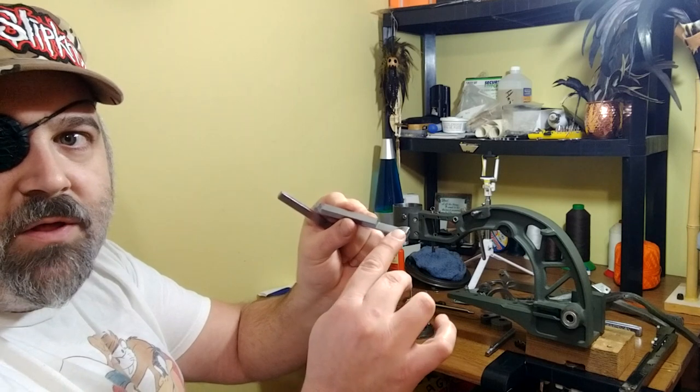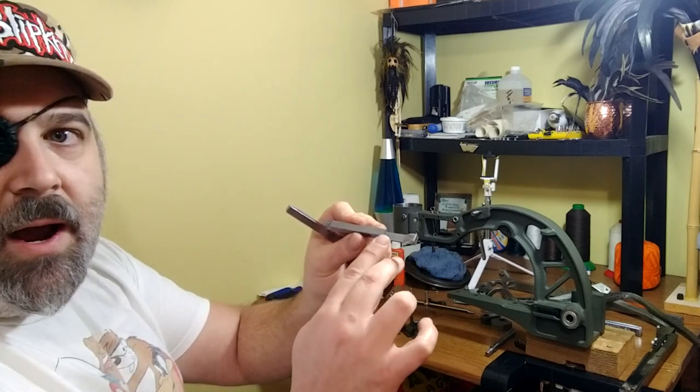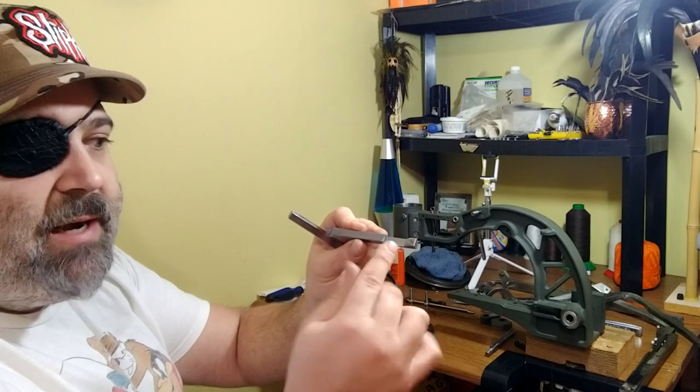We have the upper plate and both of these. There's one rod that has our presser foot on there, and then the other rod that controls the stitch length — how far the presser foot comes forward — and they ride on each other just like so. I would suggest to you guys to make sure to polish up these surfaces here, the back side of this piece and the front side of your presser foot.